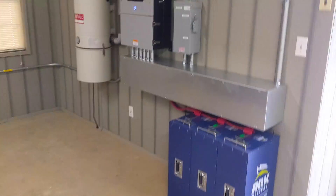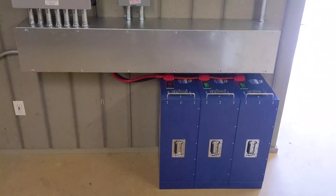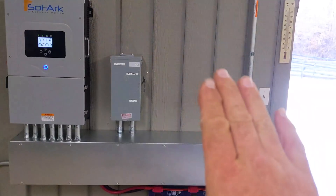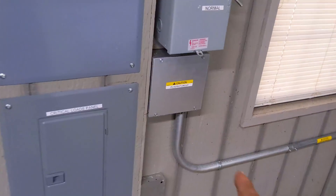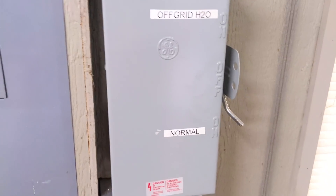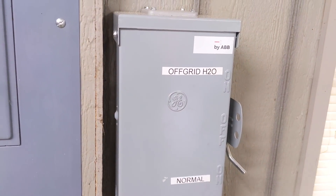It's always a good day when you pass inspection. The inspector asked to see the drawing and whether we built it to the drawing — and we did. We built the system for expansion — pretty sure they're going to go with more batteries and more inverter capacity. We moved a lot of loads into the critical loads panel and gave them a hot water bypass so they can flip it when the grid's down, fill a tank of hot water in about an hour, then shut it off and have a hot shower. It's a great load as long as you manage your power.